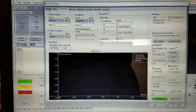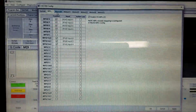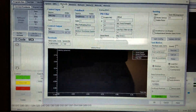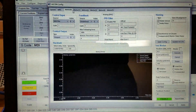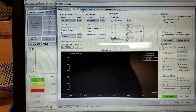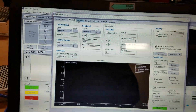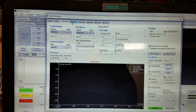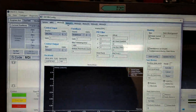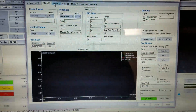The plugin for it seems to be top-notch. Everything's really clean — you can tell they had really good programmers. It talks with the Mach 4 program and it's really well integrated; it knows what Mach's doing. When certain settings you put in the plugin conflict with settings in Mach, it'll actually pop up and tell you. For example, if you're in a Mach screen trying to load backlash compensation and you press enter, a little window will pop up and say, 'Hey, you're using the HiCon board — you don't enter backlash compensation in this window, you should enter it in the HiCon plugin, so I'm not going to let you save that value.' They seem like they've really done all the right things to build this plugin.